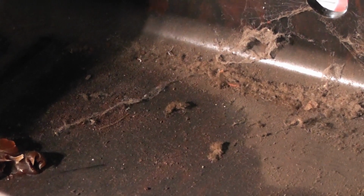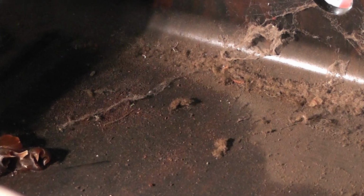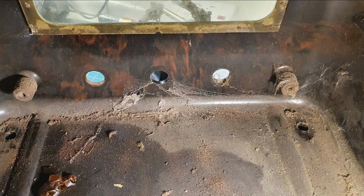The inside of the cabinet is quite dirty, cobwebs and the accumulation of dust over many years, but it's not damp, and that's one of the things I look for when I look at these old sets. There's no damp there at all, just lots of dust. One worrying little bit, and I've not looked under the chassis yet, but there is wax here. I don't know if you can see it. But there is wax here, that it looks like it's adjacent to the electrolytic capacitor, the can capacitor, which would be adjacent above it. So I have suspicions that that capacitor might be dry.